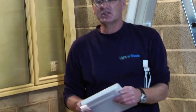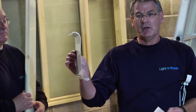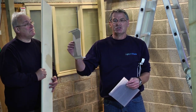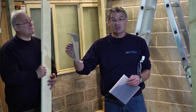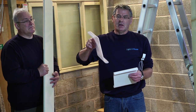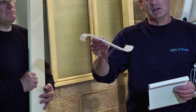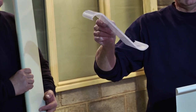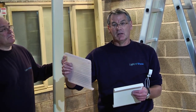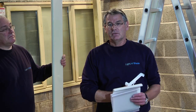The louvers we manufacture are made in two materials. The first and most widely used is powder coated aluminium — powder coating because it's extremely durable, and aluminium because it's non-ferrous and designed to go outside in all weathers. We can paint these in virtually any RAL colour that you wish, so there's a lot of flexibility and choice. The other finish is 6mm twin wall polycarbonate, which is useful where people want to keep light coming into a canopy area when the roof is in the closed position. Most roofs we do are aluminium, but we do supply polycarbonate as it gives a high degree of flexibility when people are thinking about the options for their pergola.